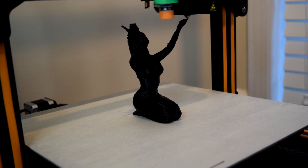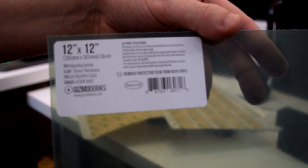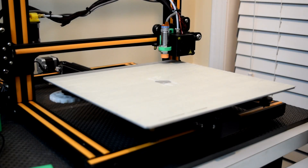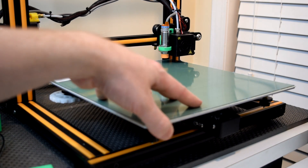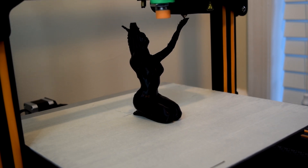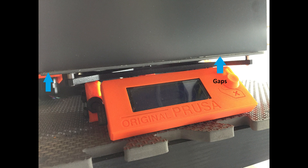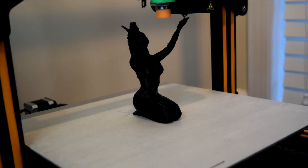It's true that plastic doesn't stick to aluminum, so you'll need some kind of surface on top to print on. For testing I've been using masking tape, but something like BuildTak or a PEI sheet will work beautifully. If applied correctly, either of these will match the exact curvature of your aluminum bed and provide a perfect print surface while still allowing the sensor to detect the aluminum. Removing the glass also makes the bed lighter, which means less potential for skipped steps in the Y-axis. The aluminum bed on my CR10 is considerably flatter than the bed on my Prusa, and the Prusa is pretty much considered the gold standard for print quality under $1,000. Either sensor will work with this Nano bed leveling setup, but if you're going for quality and reliability, you're probably better off sticking with the inductive sensor.